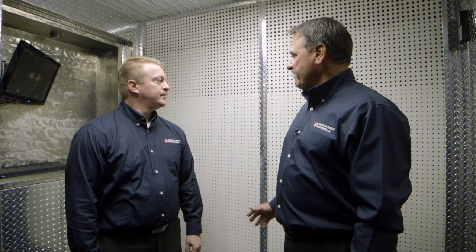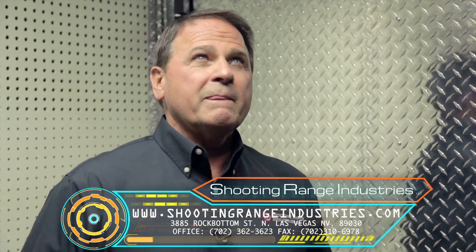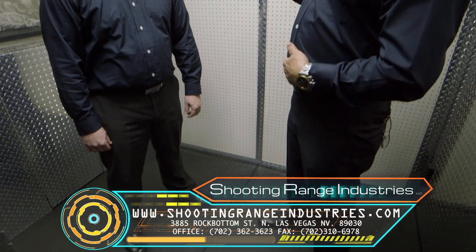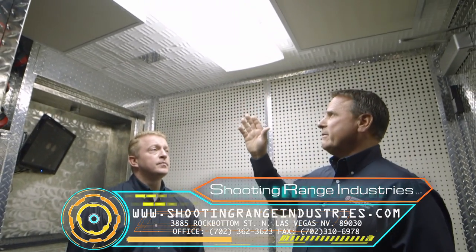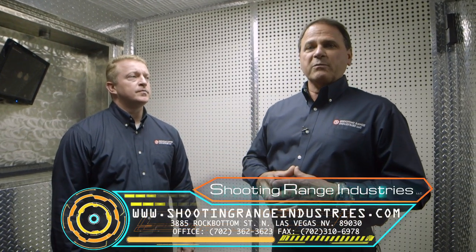So we're getting 75 feet per minute from head to floor, moving down range past the shooter, which meets the NIOSH indoor air quality. As you can see, the inside of this range is finished out in diamond plate aluminum, which keeps it nice and bright and also is easy to clean. We have a ballistic rubber floor, and we also have all the lighting completed in here, along with sonics for the sound attenuation to keep it nice and quiet so we're not getting disturbing noise outside the range while we're firing.